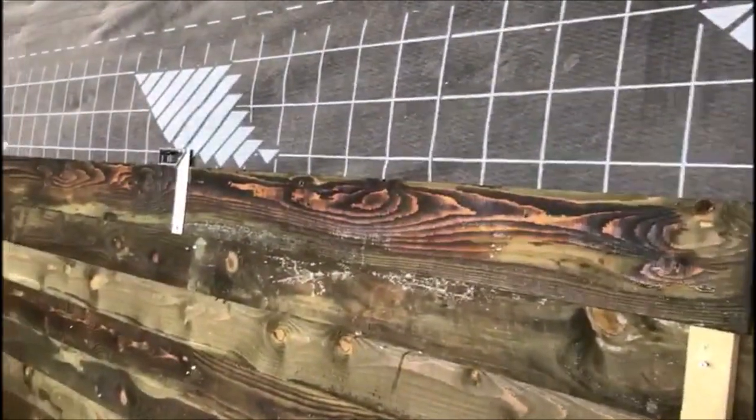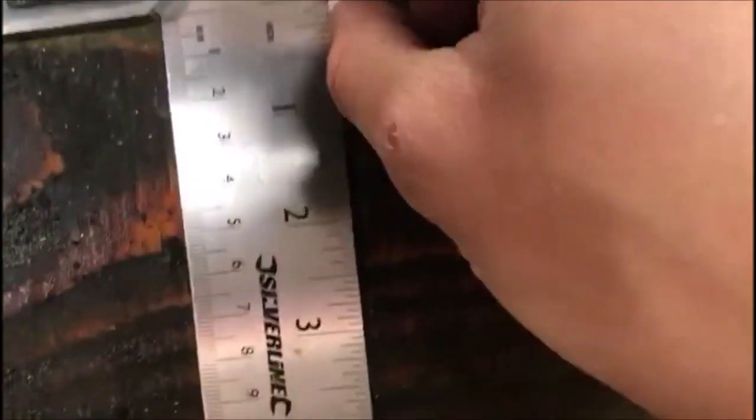I'll carry on - I've got my tunes banging because it's pretty boring on my own. So I've just dropped a new plank on. Because the joints are every 600mm, you'll see one there, one here, and there's another one here. I'm going to cut it about here, because I don't want to cut it here because then it'll look a bit messy - so I'll be cutting them all down here. If I get the tape... it's about 120mm.